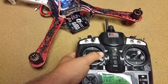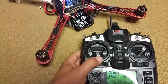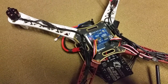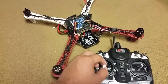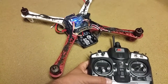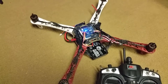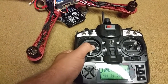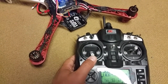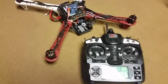You can't even disarm once it's in that stuck mode. As soon as you go to move it again it does come down, but there's something really weird going on in a software loop where it's not coming back and checking for minimum throttle. It continues to climb. I'm definitely sending zero here, and when I go up just a little bit — there she comes down, and then I can disarm. Really weird stuff.